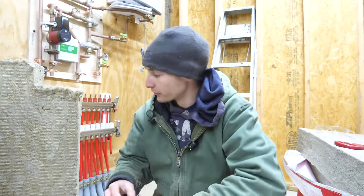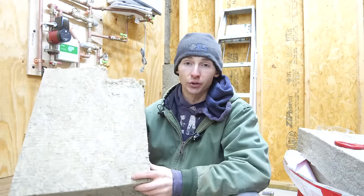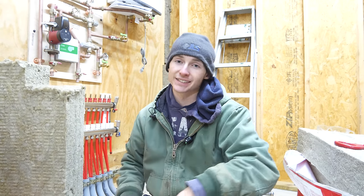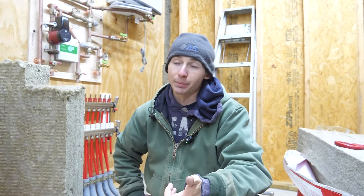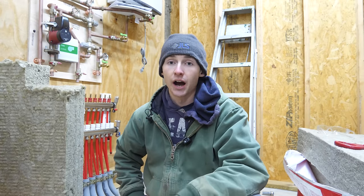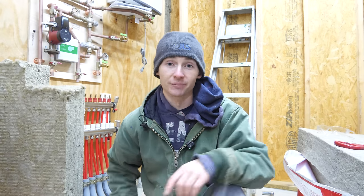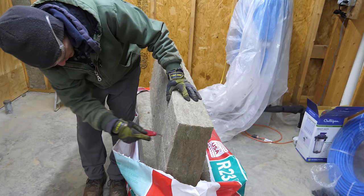For the insulation we're using Rockwool, a mineral wool batt insulation — really awesome stuff. It's super dense, R23, rated higher thermally than fiberglass. It doesn't mold, it doesn't burn. Rockwool is going to be used throughout the whole house including our attic and between floor platforms — more videos on that to come. This stuff cuts really cleanly just with a sharp serrated knife.